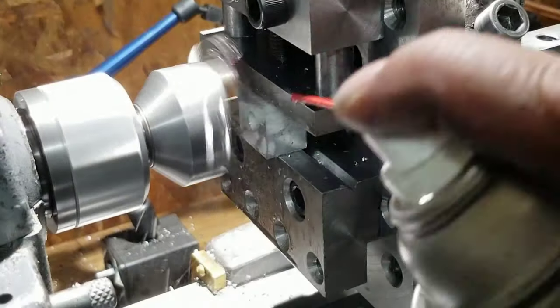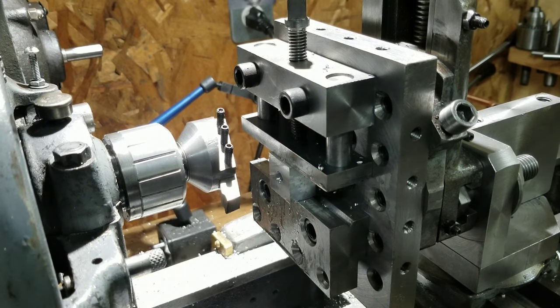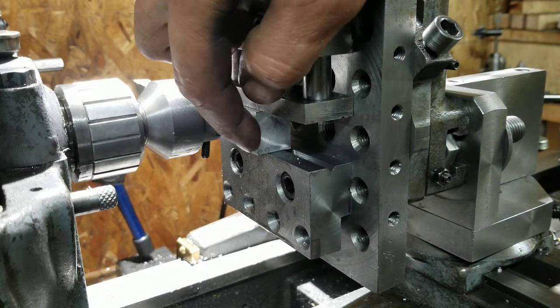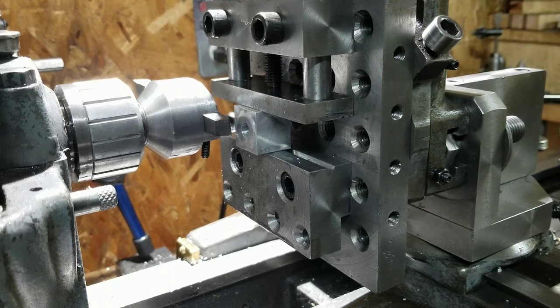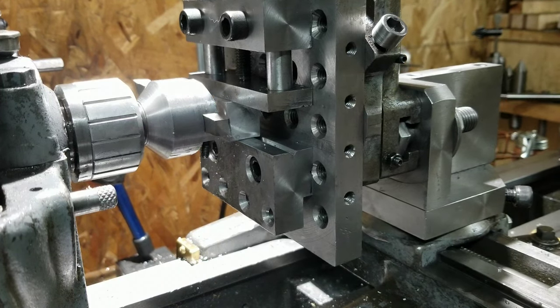Almost. Since the part is small enough, you really only have to get it on one side of the fly cutter, so the pull on the spindle isn't really affecting it. There, I just took a little 5-thou cut. You can see the wicked convex nature of that. That's pretty bad. So we're just gonna take care of those, and these should be okay after that.